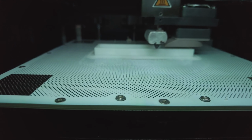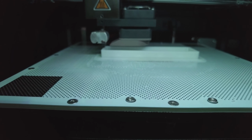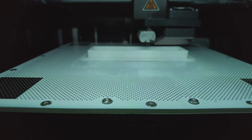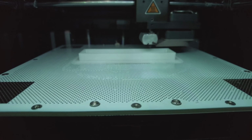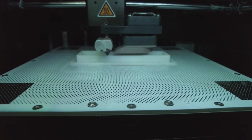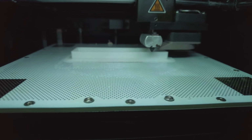I know that when I construct things like bearings or bushes or anything like that, when you gauge them, it's literally 0.02 of a millimetre out when I set it on the actual Fusion 360, from when I design it to the actual finished part. It's that 0.02 undersize. So I know that when I create anything with a hole, I just increase it.